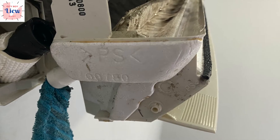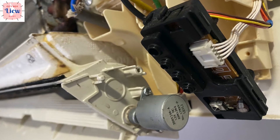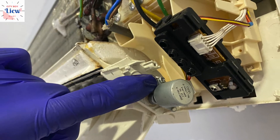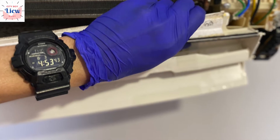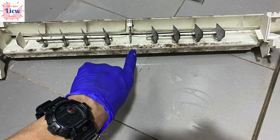Use a cloth to absorb all the water. Then head to the right side — it's mounted with a DC motor held by one screw. Remove it, gently pull it out with a tilt, then pull this drain pan down. To your surprise, the inner surface will have grown mold already.